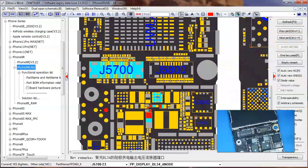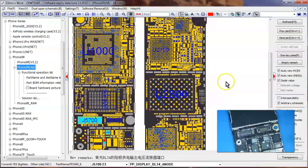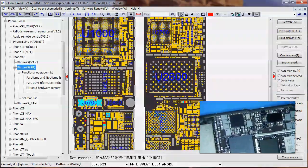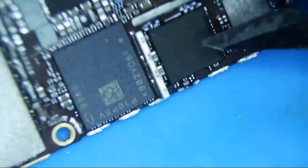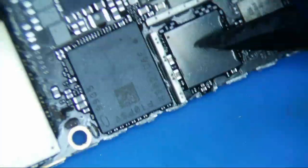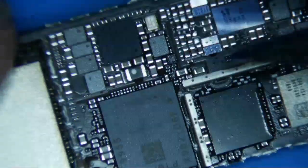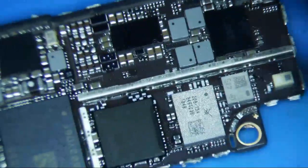These XRs are not very fun to work with because it's not very easy to take the shields off. If you use heat, you risk overheating this transceiver chip right here, which is underfilled and easily overheated. Then you'll get a searching, no service problem. So do not use heat. I have these pliers right here, which we sell in our store, and they are better than the cheap Hakko CHP awful pliers. These things are so much more strong.